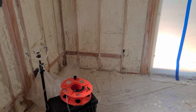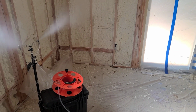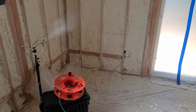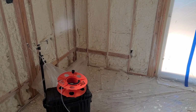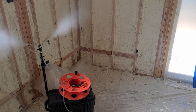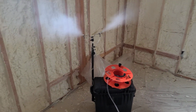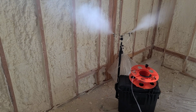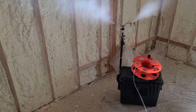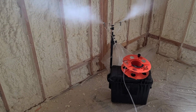Here comes the, yeah. Okay, so eventually, when they do the chemical, what that'll be is an atomized, I'm going to call it a caulk. I'm sure it's not, but it is water-based, so it's a sealer. It'll aerosol that out, spraying into the atmosphere, and then anywhere there's a leak, the pressure inside the house will take that chemical and push it. Wherever you have a difference in pressure, it's going to coagulate and seal. So, wicked awesome.